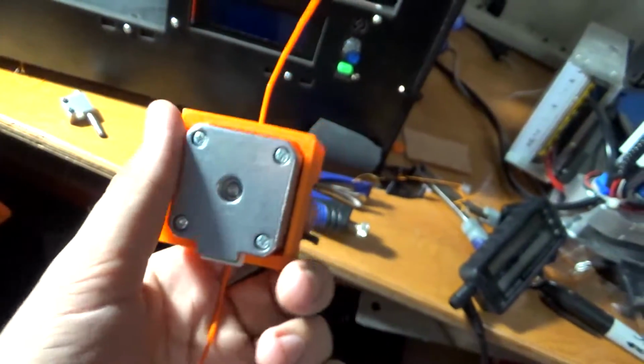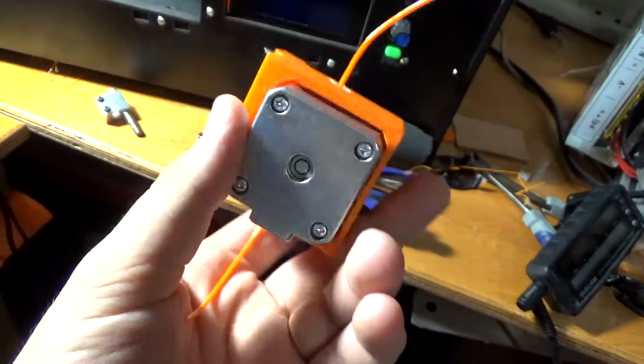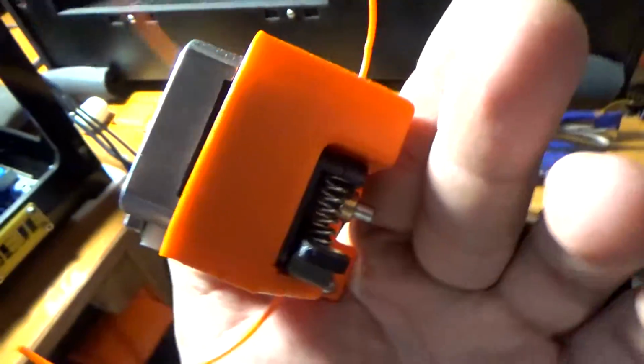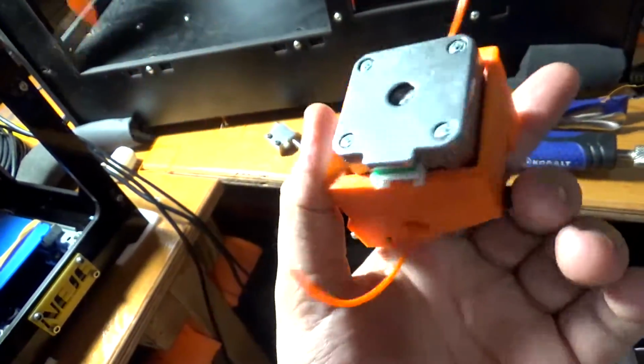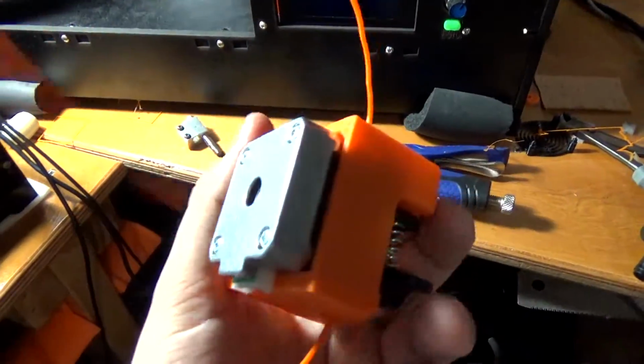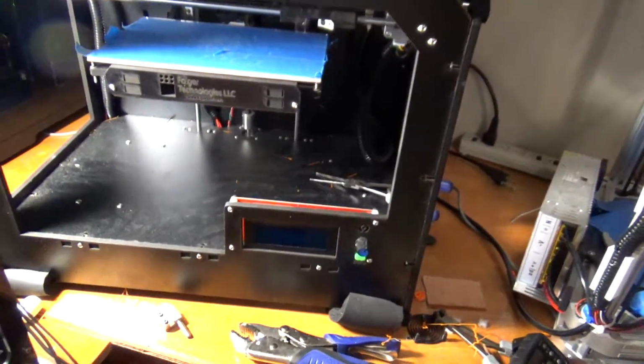When this thing clogged up, I felt this motor, and it was hotter than 32 hells. And this motor's tuned correctly. But if you also notice, this is one of these smaller steppers. This is the stock extruder that the cloner normally has. So this is a 2.6 kilogram per centimeter motor. Whereas something like the Kossel, like this guy right here, has one of the big ones, 5.2 or 4.6? Is that what it is? I'm a support, I should know this. Either way, it's the bigger motor.